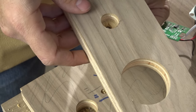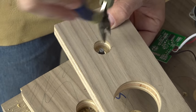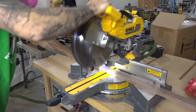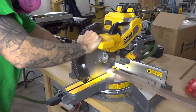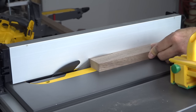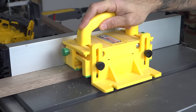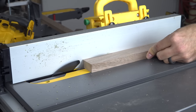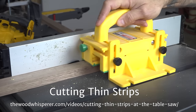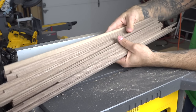The volume module inserts from the back and a small washer and nut is threaded on. Then the volume knob drops onto the post with a friction fit. Now let's dress up some of our edges with edge banding. I cut some walnut face frame stock into 25-inch long pieces. At the table saw, I'll rip them to about 1/8 inch in width. I'm using a sacrificial gripper to do this because it's safe enough to push all the way through the cut. You'll need something like 25 of these strips to get the job done.